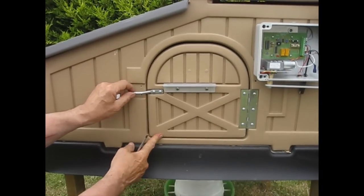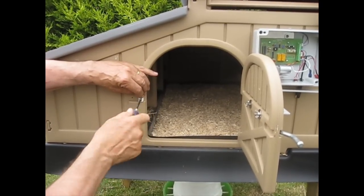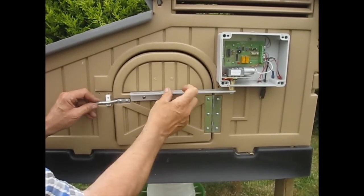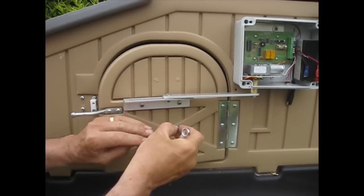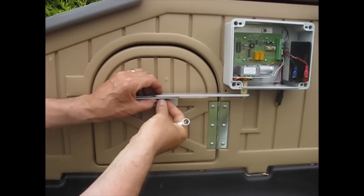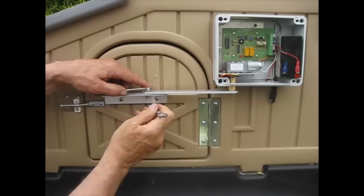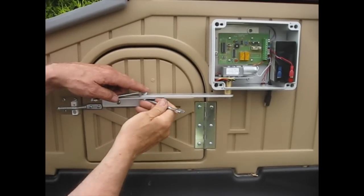The main thing is we don't want the door to catch, so we have a spacer that we fit next. Screw the spacer into the existing screw hole like that — so now the door can't go any further than that when it closes. We're going to couple this to here: it goes through here, then a washer and a nylock nut. It's better if you have two spanners for this — use a 10mm. Don't do it too tight because you need movement, but it needs to be held firmly.